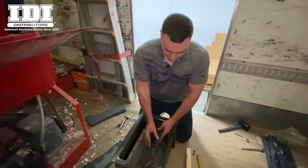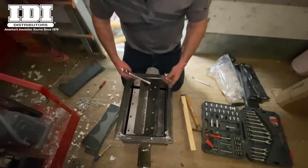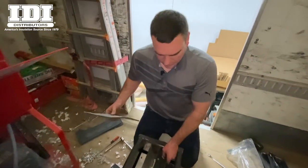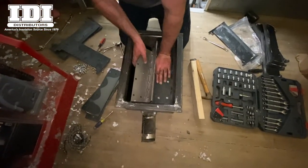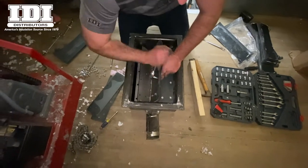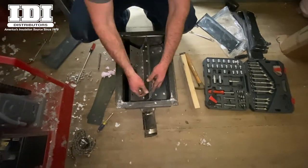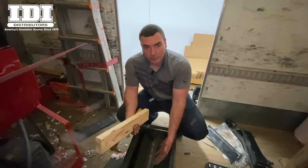We take our plate and snap that on top, then pop our six bolts through. It's important when tightening these bolts to just get them snug. If you over-tighten the seal, it will flatten down the rubber and become wavy, wearing out much faster. These are lock nuts so they shouldn't go anywhere — just get them nice and snug, do not over-tighten. As you can tell the seals got pretty tight, so we use a two-by-four and a hammer to rotate the airlock around — again, that's why I take them all out first, it makes it a lot easier when putting them back in.